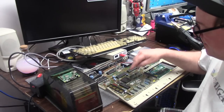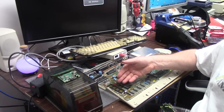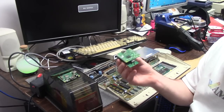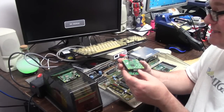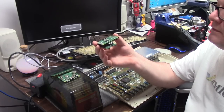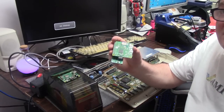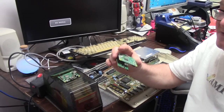I did not put a ROM. It's using a 2.04 ROM it found on the actual Amiga motherboard. We had sound, we had peripheral access, we had chipset access. It's 100% compatible in what I ran. That's it. So, you know, this is going to be a direct competitor for the Apollo Vampire. With snap-on, snap-off upgrades for CPUs, and you got this thing in your socket, it's an FPGA.